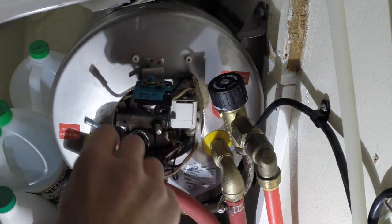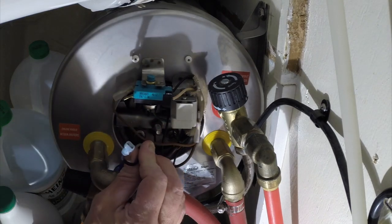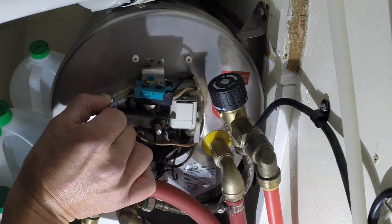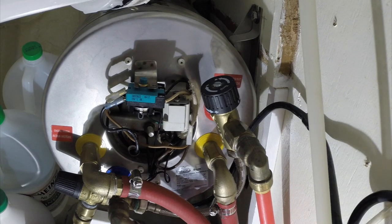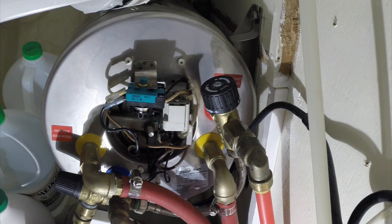This brown wire goes to the outside connection. This wire with the Ancor Marine crimp female connects to the male terminal here — this is the one I had to change last time when the wiring fried and melted the plastic cover. This is the cord plugged into the dedicated outlet controlled by the 15-amp breaker on the panel, which is only for the water heater. I'm going to flip that on and see if we start getting amps. This thing's making water — I'll leave it sit until I'm confident and then put the cover back on and watch to make sure everything's cool.